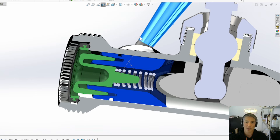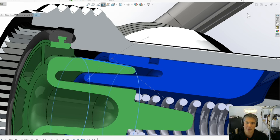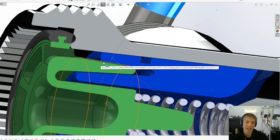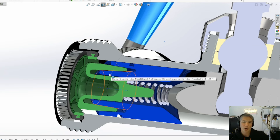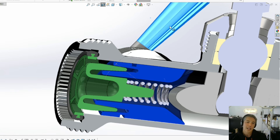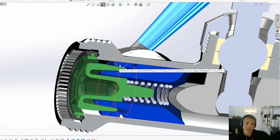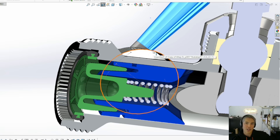We're using the momentum of the liquid itself to reduce flow speed as it exits the nozzle. That means we don't have to push the two sliding cones so hard together. Previously, relying purely on the orifice reduction caused more foaming due to turbulence as liquid passed through a tiny orifice. Now, with the direction change washing off most of the flow speed, we don't need to close the cones as far. This gives excellent control over a much wider range of pressures — even up to 30-40 psi where many flow control taps struggle — and handles highly carbonated beers that are very tricky with conventional flow control mechanisms.